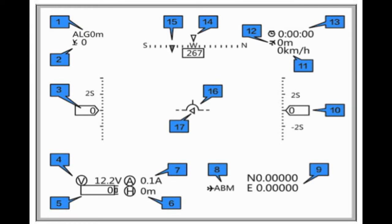Right below that, number three is your airspeed and GPS speed. Then below that we have all the battery information: number four is your battery voltage, five is battery power consumed, six is your distance to home point — very important — and seven is your power battery current, which is one of the things I look at quite a bit. Number eight, right next to that, is your flight mode — so you could be in stabilized mode, return to home, circle, or similar — and beside that we have the current latitude and longitude of the plane, which could come in handy if you were to crash.